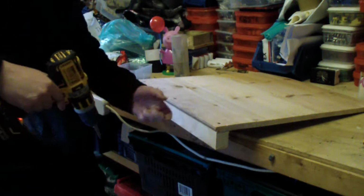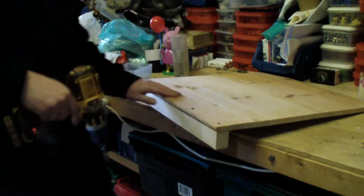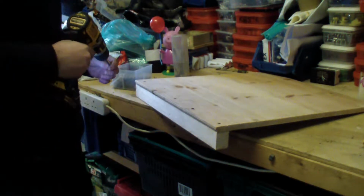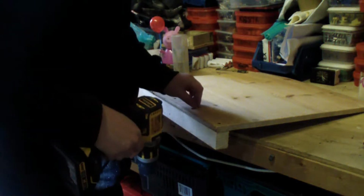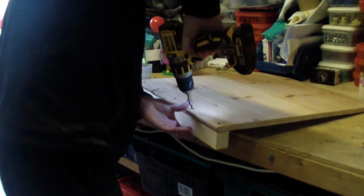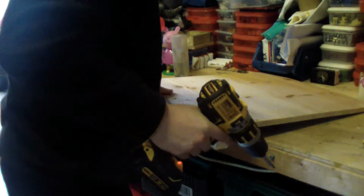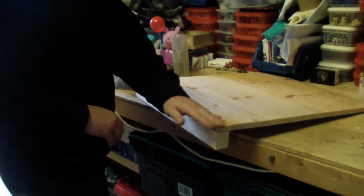So, why am I doing this? Well, 3D printers print plastic out, obviously, and they do that by heating up the filament, and in my case they do it by heating up the bed that they lay that filament on. I normally print ABS, so that requires the bed to stay quite warm throughout the process. I typically run the bed at about 110 whilst it's printing.